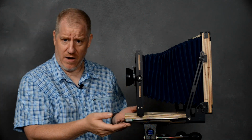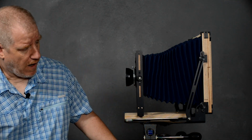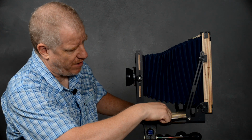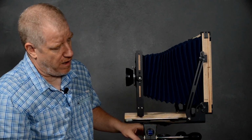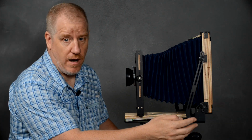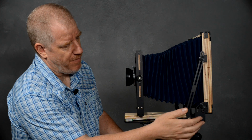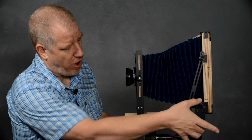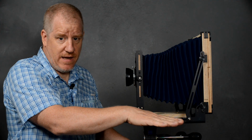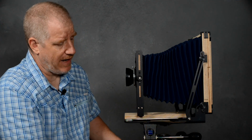I think there's a couple of things that could be done, right? This could be made thicker, but that would make the camera heavier. Most of this distance here, and I think you're about 6 inches from where it's a plate to that corner, most of this is flat. Do you see how right here, this is a stamped piece and this is bent up, so that's really tall and that's not going to flex. It's the flat piece, right, that's being held horizontally that has a little play in it.